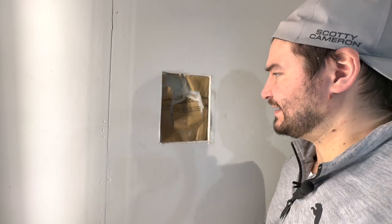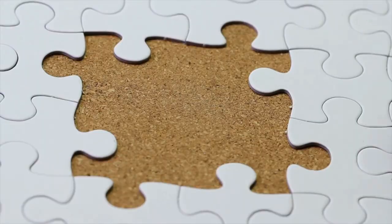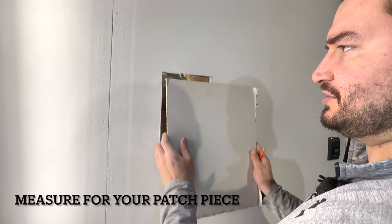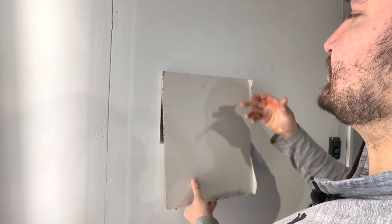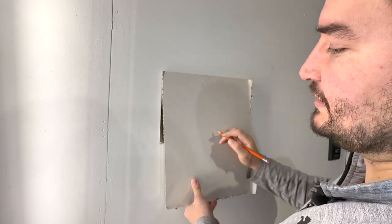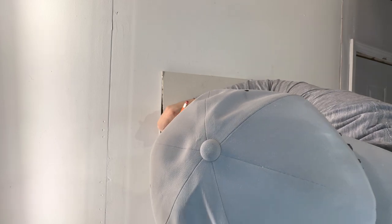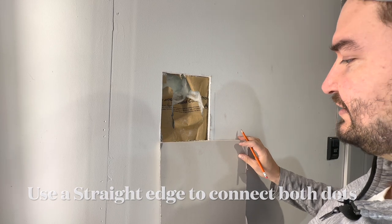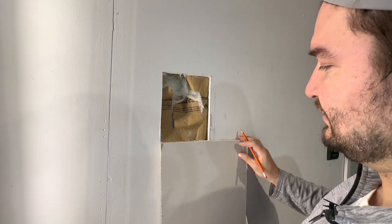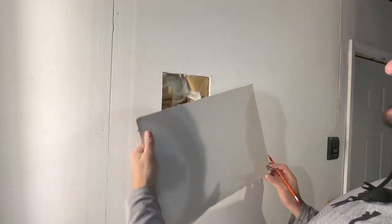Nice to see that my garage is insulated. Now that the hole is cut, we need to get a piece to fit it. You can put your drywall piece up, snug it in the corner, and get your marks. We can see the hole is square as I like it, though my cutoff piece is not square.